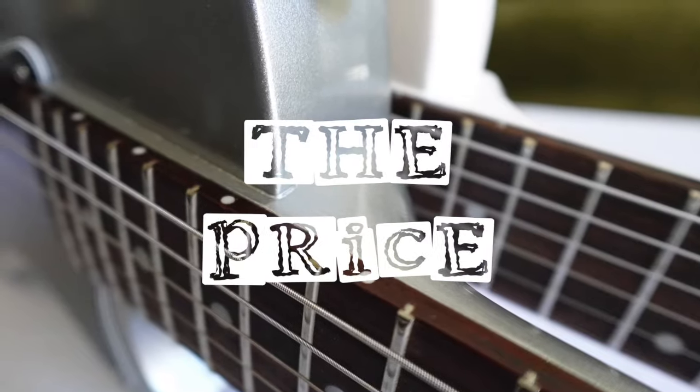Now, if we move both of these guitars to the meter, the Gibson looks like it's at about 16.39 here, and the Epiphone reads about 8.54, so significantly hotter for the P90 DC pickup.